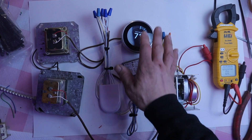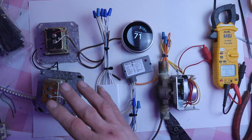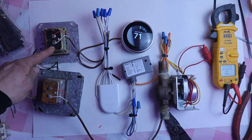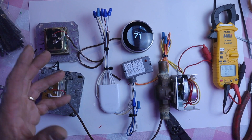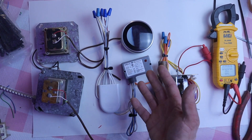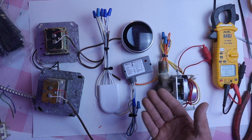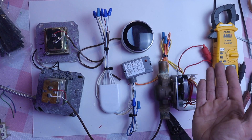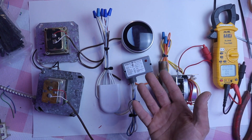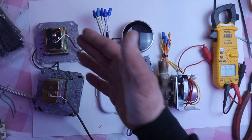I'm going to go ahead and test the thermostat. I suggest you do this after each thermostat you install — not only to confirm it works, but also because a lot of people ask how many Nest thermostats you can run off one transformer. There's really no straightforward answer because there are a lot of variables. When you get this wired up, turn your power back on and test it. As you install another thermostat, test it before moving on to the next one. By doing it one at a time, if you're wiring in five Nest thermostats, you might get to thermostat number four and discover power problems — meaning your transformer is topped out and you'll need to add an additional transformer.